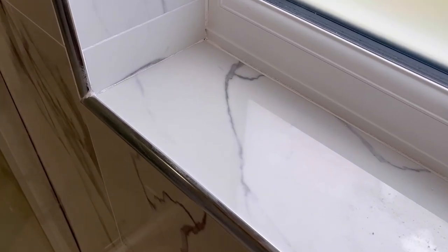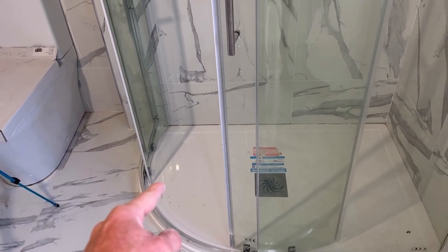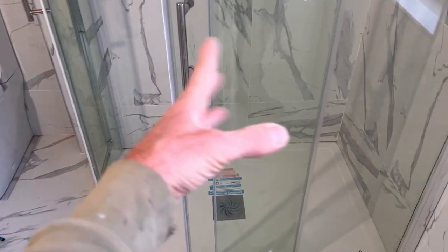So that is what you want to achieve — you want it all nice and clean. I'll show you mine — that's nice and clean with no grout or nothing in there at all now, because what you don't want is when you're using the tool I'm going to show you, you run it across the grout and the little bits put a horrible finish to your mastic. It's just easier for me to show you on the window prepping that than it is to get inside that quad, so I'll clean that out and show you a bit of a shot of that.